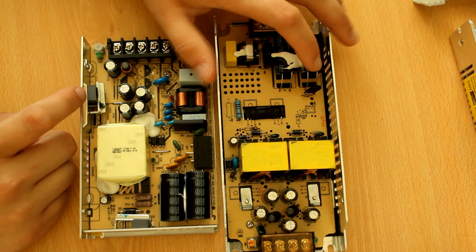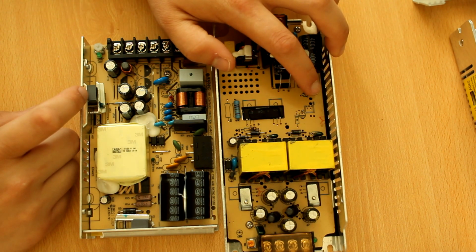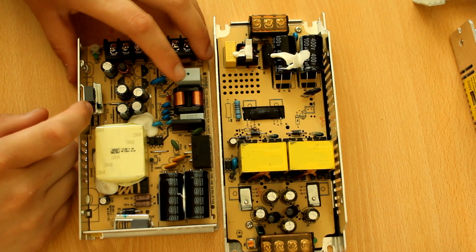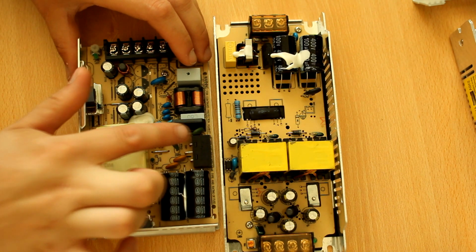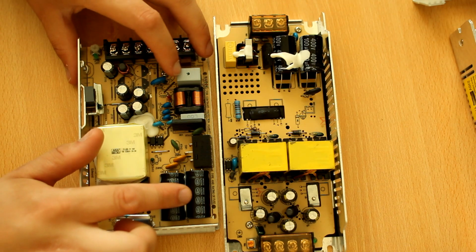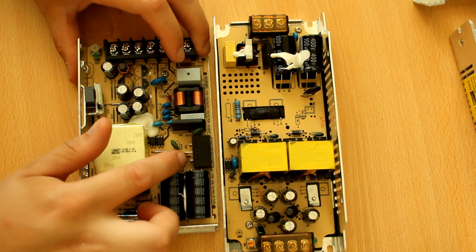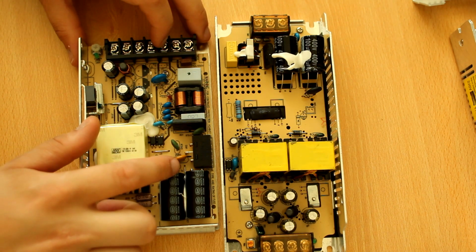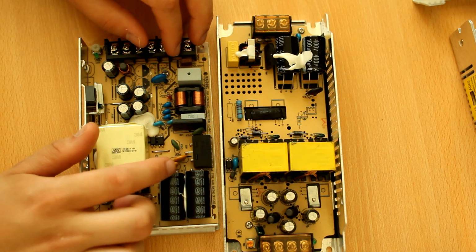Kind of interesting to see is that they do actually have overvoltage protection. This is marked RT1, variable resistor, so this is almost certainly an MOV. And here, the same. Oh, actually, excuse me. This is RTH1, and this is RTH2. So these are two thermal resistors, which means NTCs, which is inrush current limiting. This doesn't actually have inrush current limit. This is just an overvoltage protection thing, and I think these are marked ZNR5. So these two are probably the actual overvoltage protection diode. So that's all right. It's nice to have transient protection.